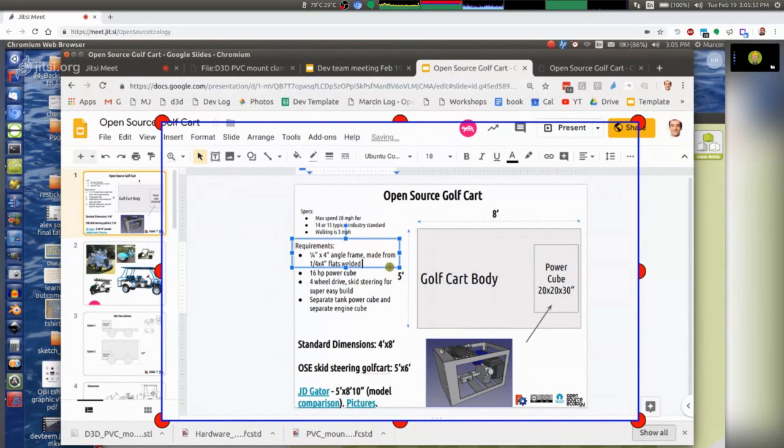For now we'll do simple construction. For the frame, it's convenient to use quarter by four flats — cheap, accessible — welded into a very large frame, just like the large frame of the one-cubic-meter 3D printer from quarter by half flats. Here we'll use quarter by four flats to make a huge frame out of six sides. Even without the torch table, cutting that quarter inch by hand is pretty easy.